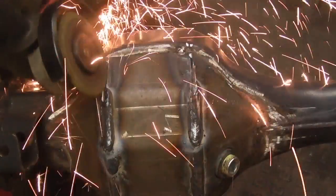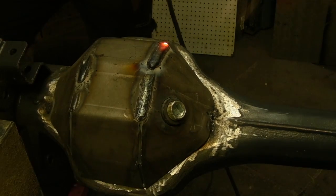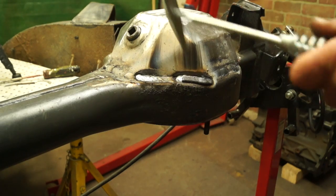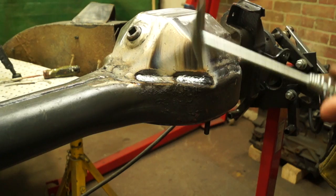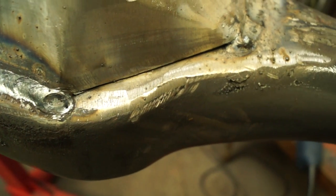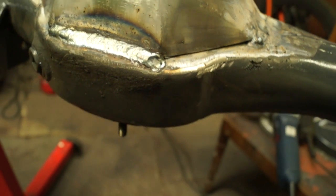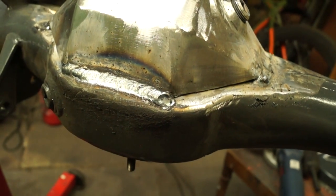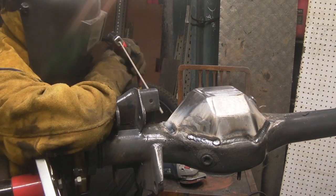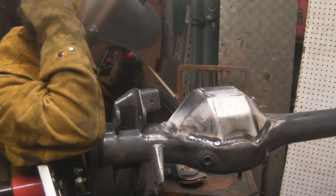As I mentioned in the last video, I told you that I'd ground it back and then run the weld over where I ground, so we're not going to get any chance of a leak. I'll just take the slag off here and you'll see what I've actually achieved. It doesn't look very pretty. What I'm saying about gaps here — these can cause problems. You can get undercutting when you push the weld in there because it gets a little bit too hot. I'll just run the weld on here and show you what I've achieved by it.